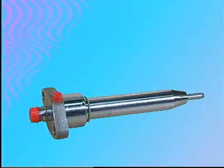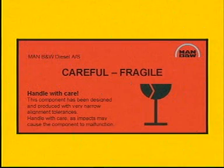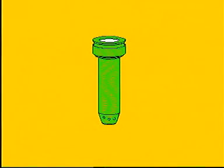When overhauling fuel valves, handle all parts with care and keep them clean. Careful handling applies particularly to the spindle guide and cut-off slide, as any rough handling of these components may cause them to malfunction. Do not clean the fuel nozzle with a rotating steel brush, as this may damage the spray holes. If cleaning with diesel oil or the like is insufficient, use emery paper to clean the spray holes.